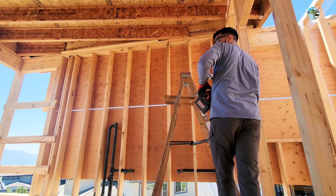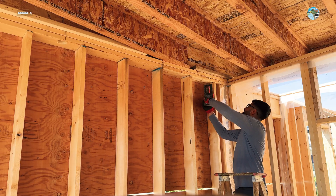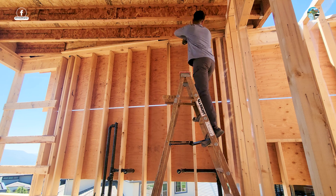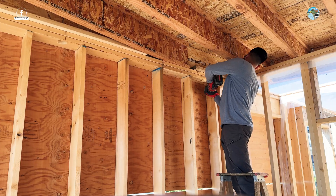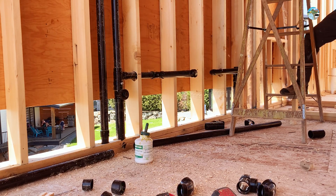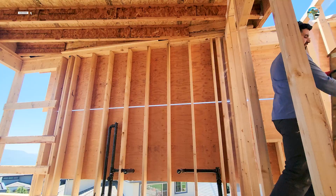There are a lot of fixtures in a house, but you don't see as many vent pipes penetrating through the roof. The reason is that a single vent can serve multiple fixtures in a house, which reduces the amount of pipe required to plumb a system and minimizes penetrations through the roof. That's exactly what we are doing today — connecting both vents together in the TJIs and penetrating one vent through the roof.